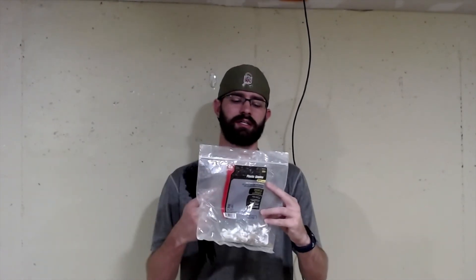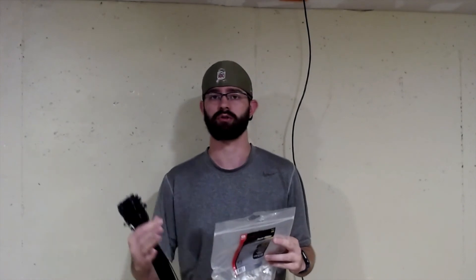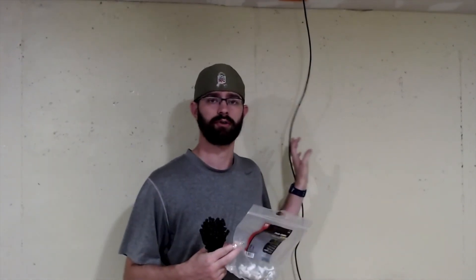There are a few tools I would suggest that you have. When it comes to mounting or securing your cables, zip ties are a really good thing to have around, especially if you're in a warehouse setting with extremely long runs — you want to zip tie about every 15 feet or so. For homes, these plastic staples made for electrical wires are fantastic for working with ethernet cables as well. I use staples typically in a household environment and zip ties in a warehouse or shop environment, with a mix in an office environment.